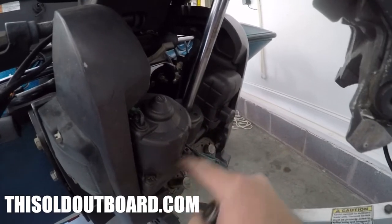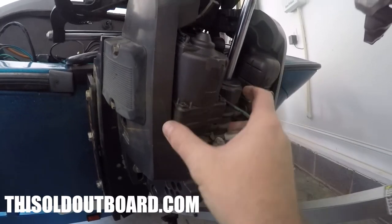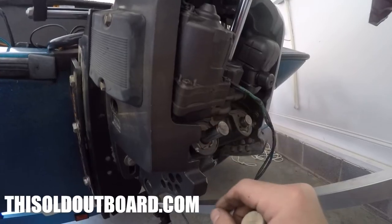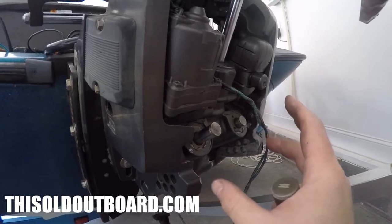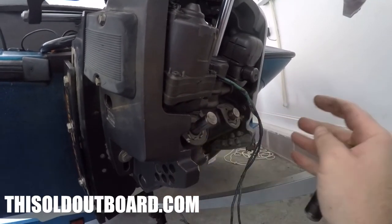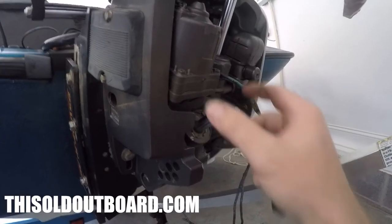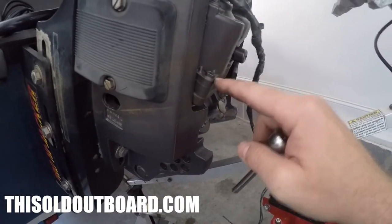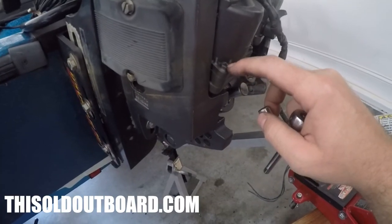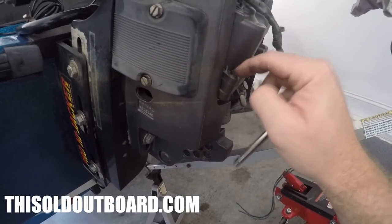Now we can reach the four screws on the back side. If you have a system that's really greasy or dirty, clean out this area really well, because when you unbolt this and break this surface, you're going to expose the cavity that the hydraulic fluid is in. You don't want any debris in that area because there are check valves, screens, and passages that you don't want clogged up causing more issues than you already have with a bad motor. These fasteners take a 3/8 inch socket — they do have a cruciform for a Phillips head, but I think it's best to use a socket so you don't risk stripping them.